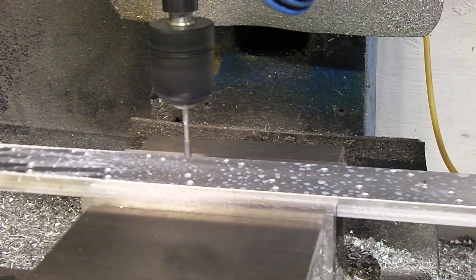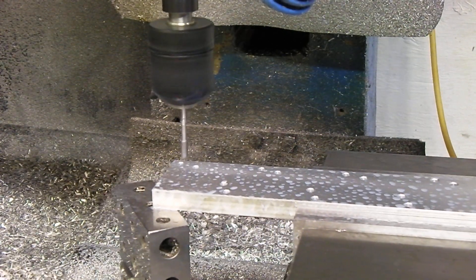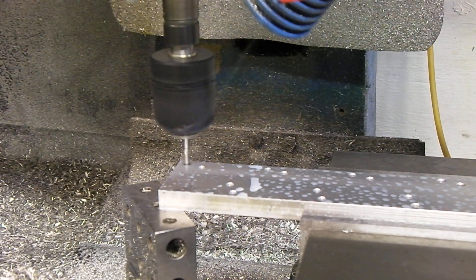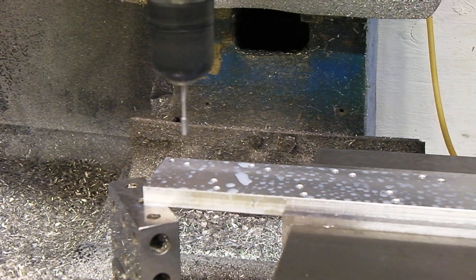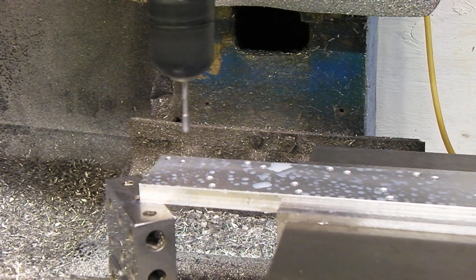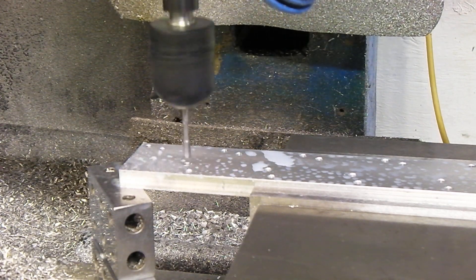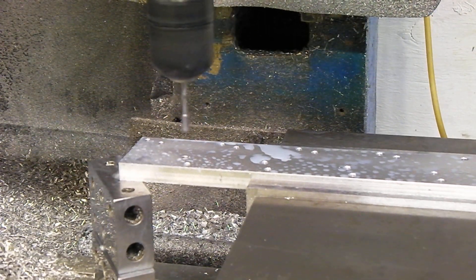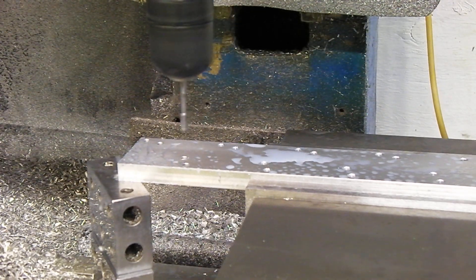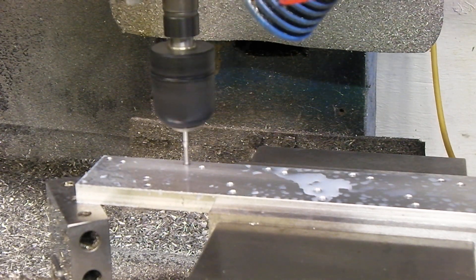With a roll tap you have to use a different — in this case larger — drill bit. On my clearance plane I set it to one inch, just in case something sticks. My tapping head normally takes a special collet for each diameter shaft of your taps. I bought this one used and it didn't come with a set of collets and I couldn't find any, so I ended up using an old drill chuck from a portable screw gun. I turned the shaft down and made an adapter piece so it locks in.